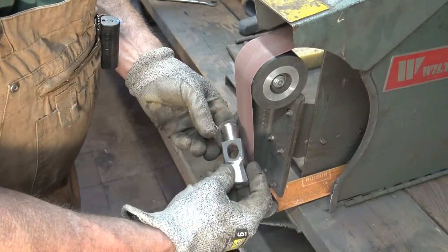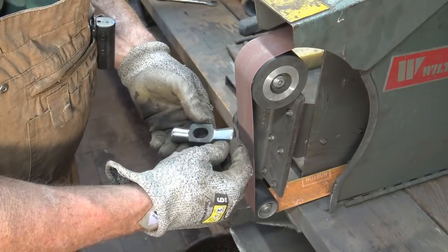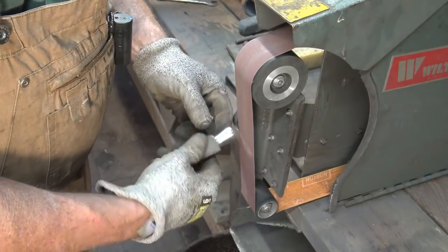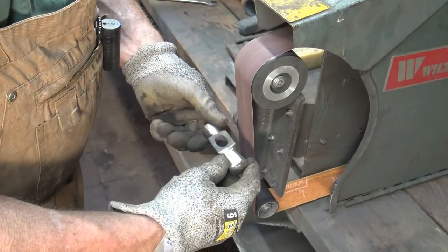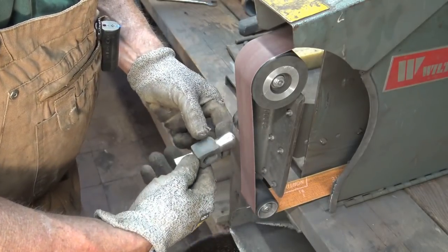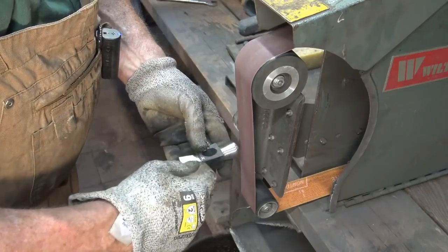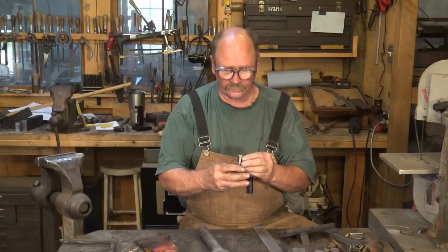I've repeated all of the same steps with a 60-grit belt, a 120-grit belt, and typically a 220 belt, but unfortunately I'm out of 220 belts so I actually went to a 400-grit belt, which will leave a smoother finish but takes a little bit longer since it's such a fine grit. I don't think all of this needs it — ultimately the faces I will polish, but the sides I will leave black after the heat treating.